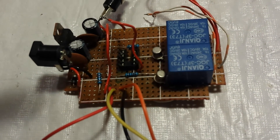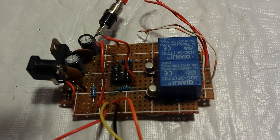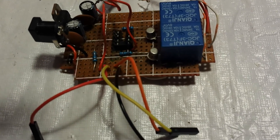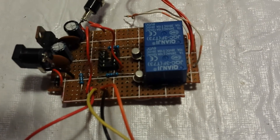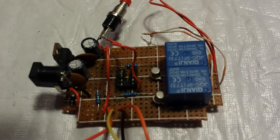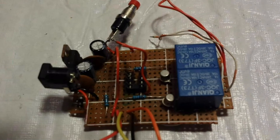In this view, you can see the components permanently mounted. On the left is the voltage reducing supply, which transforms 12 to 20 volts to a regulated 5 volts DC. I prefer to use a socket for the microprocessor. Applying heat directly to the pins of the PICAXE 08-M2 probably wouldn't hurt it, but why take chances? I'll install the processor later. Towards the right, you can see the silver 2N2222 switching transistors, which receive the output from the processor and do the actual relay switching.